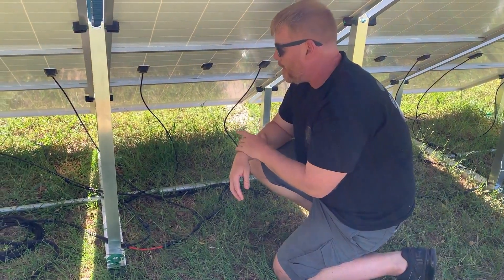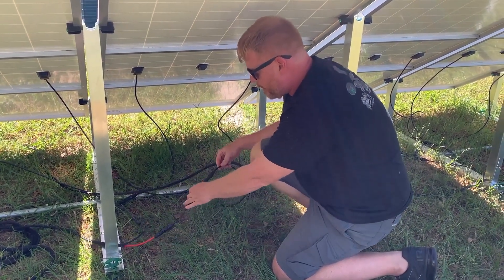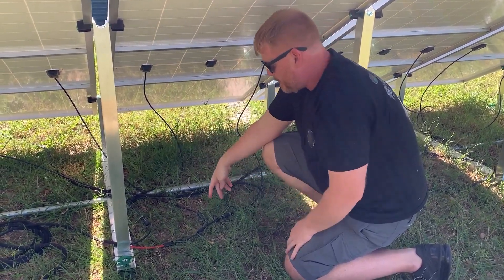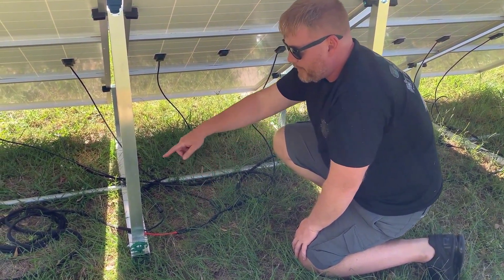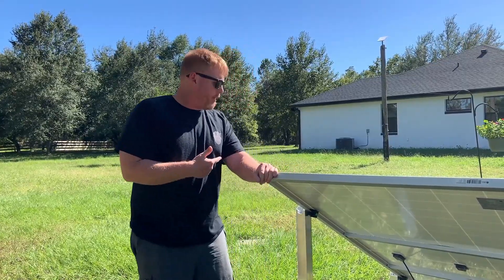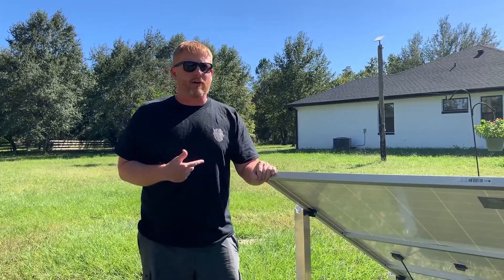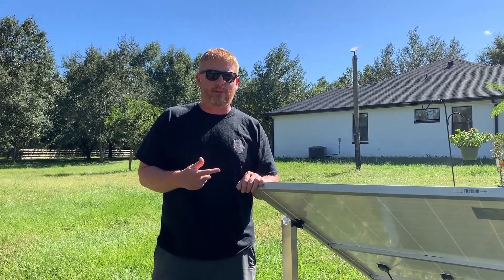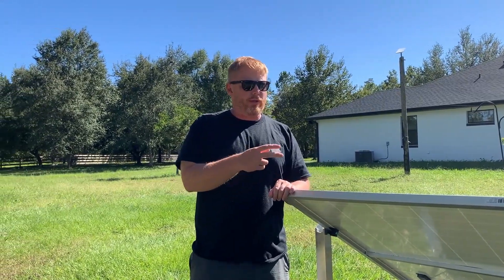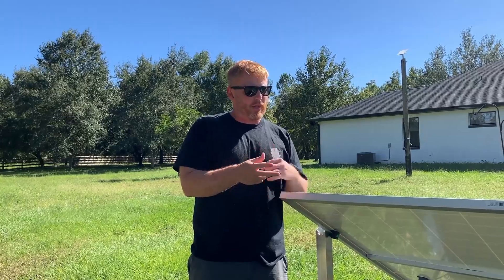The big difference under here is that rather than having a triple adapter, we have double adapters and we run positive to positive, negative to negative into these double adapters. From there we have a 100-foot run of MC4 cable that takes you to the house. That 100-foot run of 10-gauge wire is actually the source of a lot of our headaches, because it gives us more voltage drop when we're running 27 amps. You have two choices: either buy thicker wire to reduce resistance, or shrink your circuit and run less amps. In this situation, we're running less amps, and that really boosted our production.